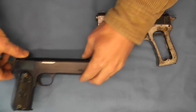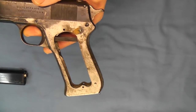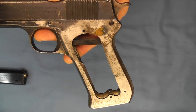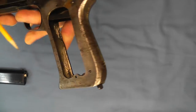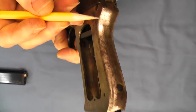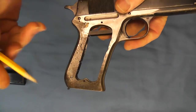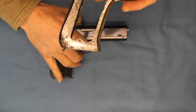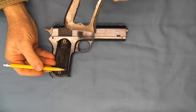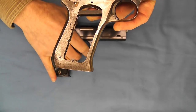Let's go ahead and take a closer look at the pistol here that has been modified. We can see there's a lot of work in progress. You can see some scribe marks here where the hole was located. You can see some areas too where it looks like it's been welded and filled in here on the back. And then, bringing this other one back into frame, you can see how the front of this one is just straight up and down, whereas here you can see how this one is swept out, giving you a much better grip on it.